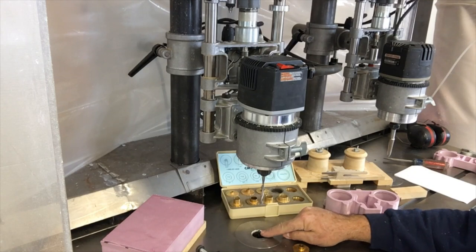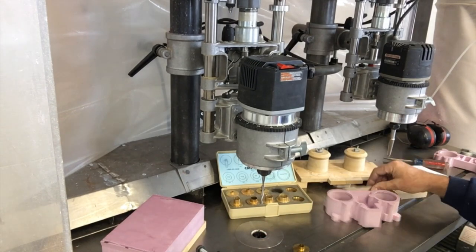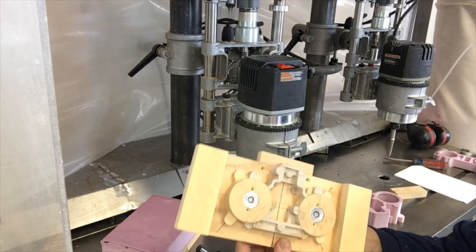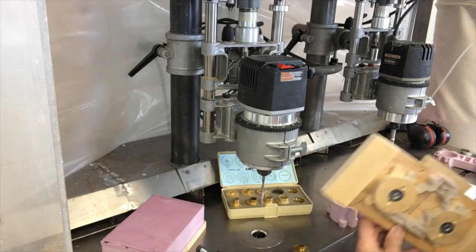And one of them is the guide pin. What I use for a guide pin is a dowel pin. In this case, it's a quarter inch dowel pin and a quarter inch cutter. That means that when you have a pattern, like say this, that's on the bottom for my carburetor main well body, it's going to trace out and cut that exact same size as that pattern profile is on the bottom.